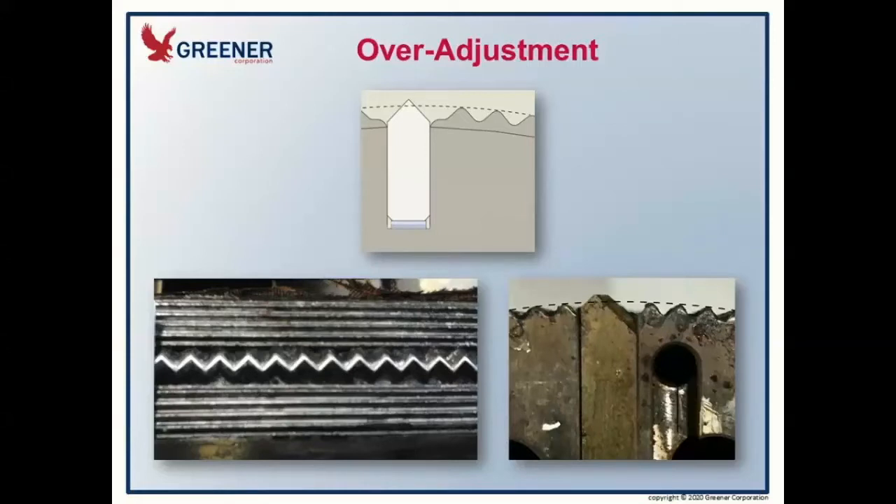That's often missed — by the time things get there there may have been other adjustments made, so we do recommend checking those parameters before moving on. One of the things mentioned earlier is over-adjustment of the knife. By over-adjustment we mean that the conical screws have been turned to push the knife cutting edge out above the jaw face, or enough shim has been added that it's sticking out above the jaw face. This is easy to notice just by looking at the sealing jaws and knives on the machine. In cases like this the knife is worn out and you're causing yourself seal problems.